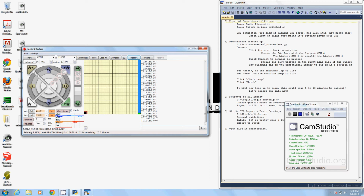If you get little gobbers that are kind of loose, for the most part you can just leave those in there and it'll print fine. If it does screw up here, you can just reset the print, cancel. When it's pretty warm like this, usually you can just scrape it off with one of the squeegee boards pretty quickly and start the print over again. But little mistakes, little problems, those will usually work themselves out so long as your print's adhering properly. These next few minutes are probably a point where you want to pay the most attention to your print.